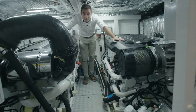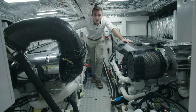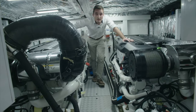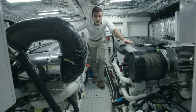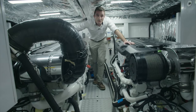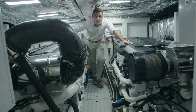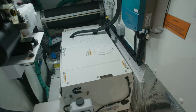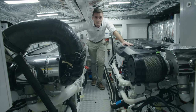After the engine room there is room for an optional gyroscopic stabiliser, which is the Sea Keeper 9 we offer, and it proves very effective indeed when the boat's out at sea. You've also got the option to add an air conditioning plant in this space, which offers 78,000 BTUs of air conditioning capacity. The boat comes standard with a 9.5 kilowatt generator, which can be upgraded to 17.5, should you go for the gyroscopic stabiliser or the air conditioning as well.